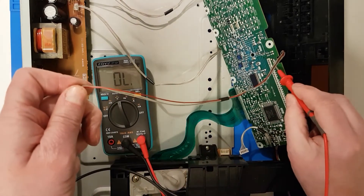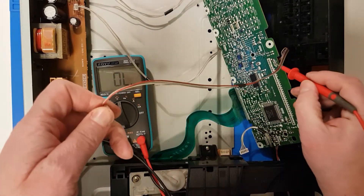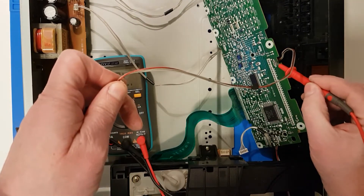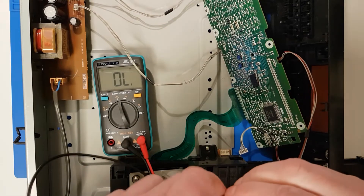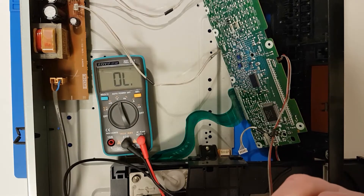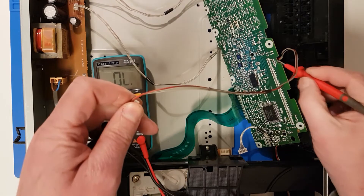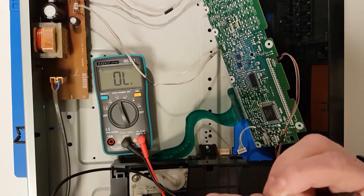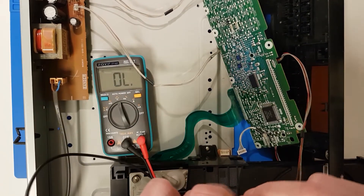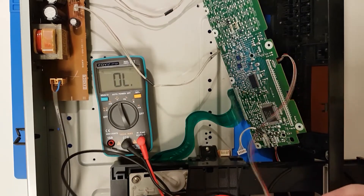Now this is my very first upload to YouTube, so bear with me. I lost the audio track of this clip — it's beeping away nicely and there seems to be nothing wrong. But I made the mistake of diving way too deep to start with, and ended up measuring the display controller chip. I found the service manual online and measured some voltages from the schematic. It turned out that the required 30V was not entering the display controller chip, so I decided to trace the voltage starting at the power supply, which I should have done first.